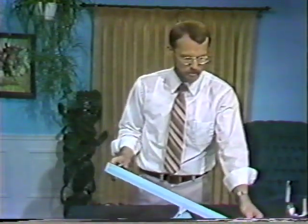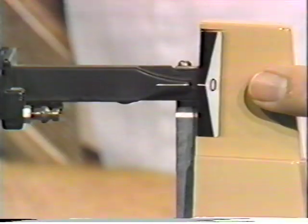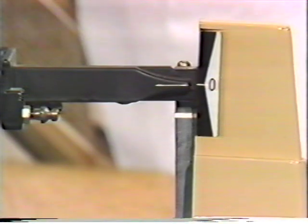You know your body mass — maybe you express it in pounds, which is a known standard. Another standard unit of measure is the gram. We can find the mass of an unknown in grams using a triple beam balance. Although it doesn't look much like it, the triple beam works on the same principle: an unknown mass is compared with a known standard. These three beams move in seesaw fashion and support movable riders of known mass. The unknown mass goes on the pan, and a pointer indicates when the known and unknown masses are in balance.